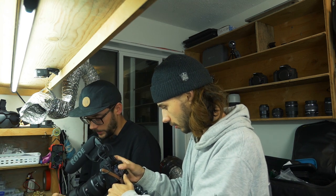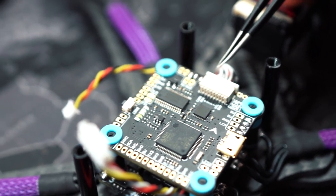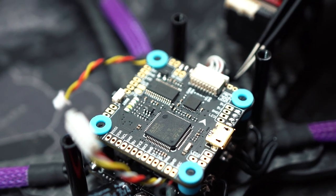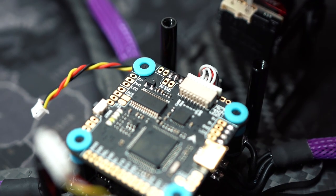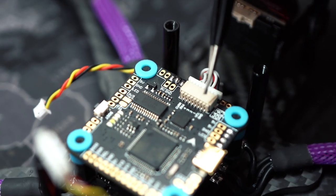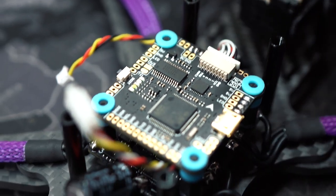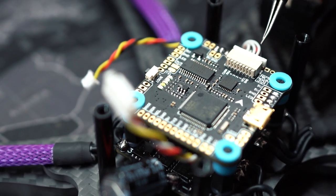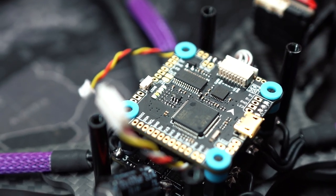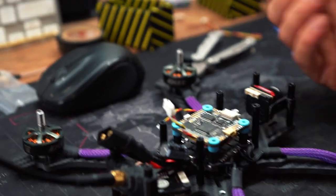And then two, right here, if you take this cable and you reverse it, which is what I had, this part was connected to the ESC, the other end of the ESC was plugged into here, and the red and black wires were over here. If you look close, it says ground VCC there, which means black and red. VCC is unfiltered power coming from the battery. So we had it opposite, which luckily didn't smoke anything out. We did check for continuity, so we know it wasn't shorting anything, but it just didn't work. So we swapped this wire around and now we're getting power.